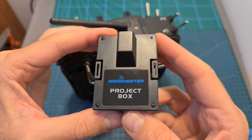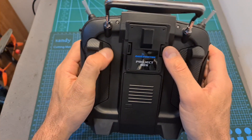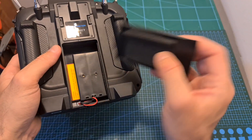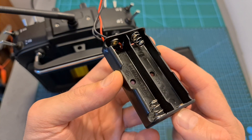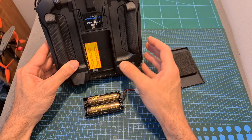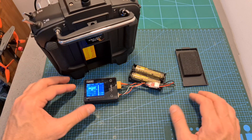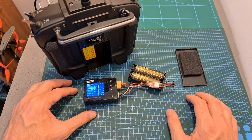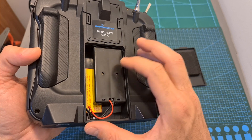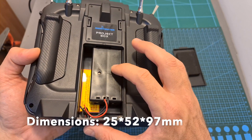The bay is not exposed and the TX16S comes with a project box which you can use for creating custom DIY radio modules and also for protecting the module bay when it is not in use. Under this sliding door you can find the battery compartment. Inside you can find the battery case that accommodates two 18650 lithium-ion batteries, which are not included. You can charge these batteries either internally using the USB Type-C connector on the bottom, or externally a bit faster using an adapter with your regular LiPo battery charger. The battery compartment is also much bigger than the battery case, so you can use bigger cells or other compatible 2S batteries.